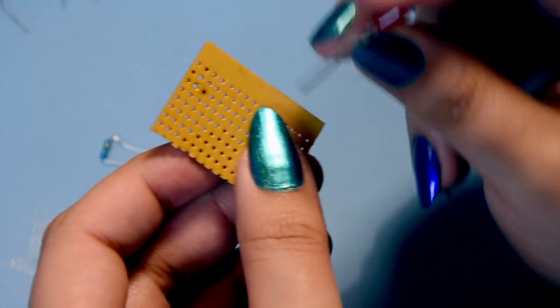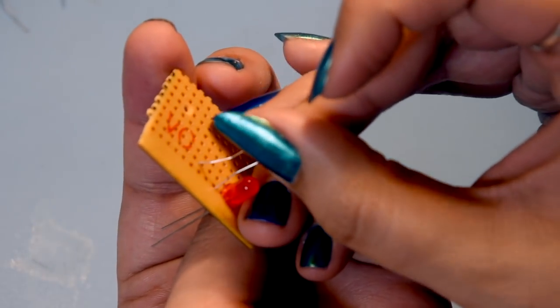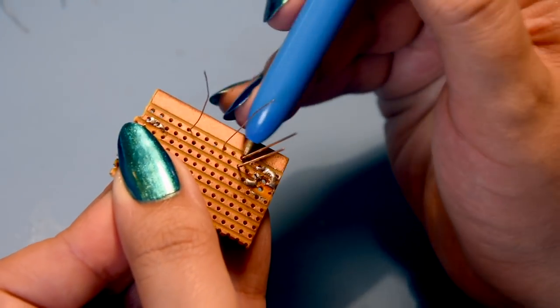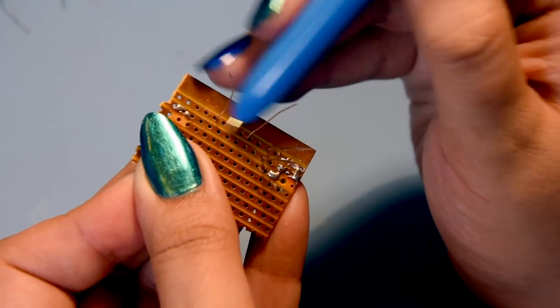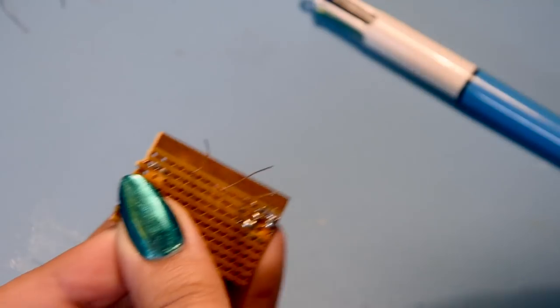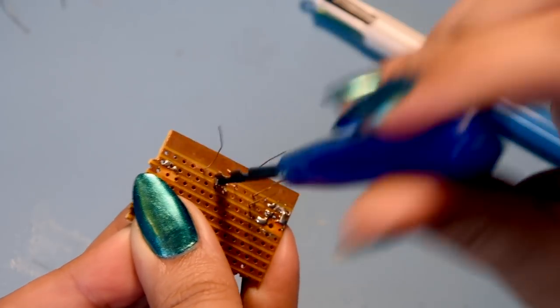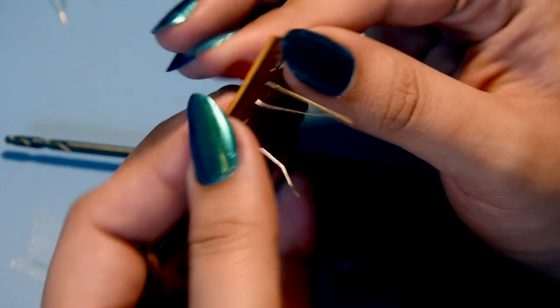Put the LED back in and you need a resistor placed next to it. However now you have a problem - the LED goes to the resistor fine, but the resistor is also joining the same strip, making it redundant. What you need to do is solder them in and use something called a track cutter - it's like a drill bit with a handle. You rotate it a couple of times and you've cut the track, isolating that section. That's basically how you create a circuit on Veroboard.